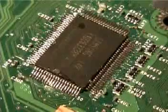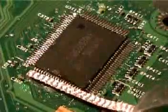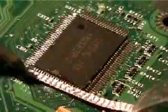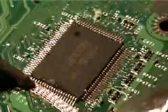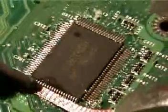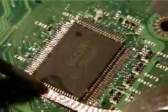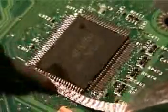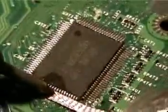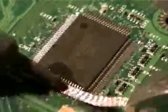Next step, take some soldering wick, lay it over where you're planning to remove solder, and heat it. I don't do the whole desoldering wick like some people do — do a little piece at a time and pull it up each time, otherwise you may have a problem with the wick sticking and little pieces of copper getting stuck, which will not be good for installation later.